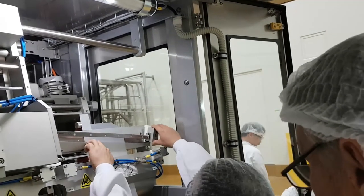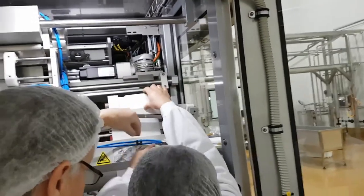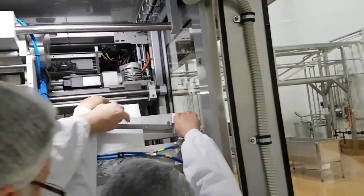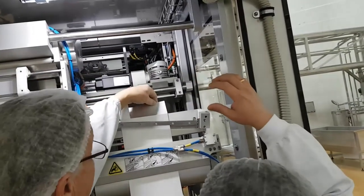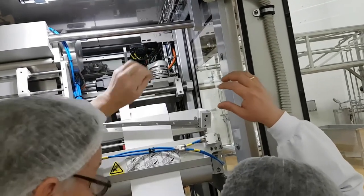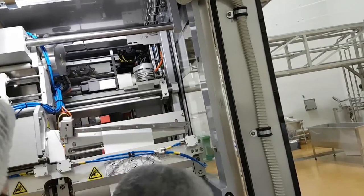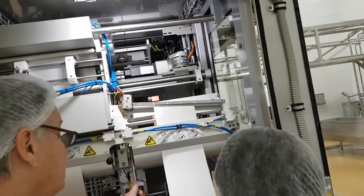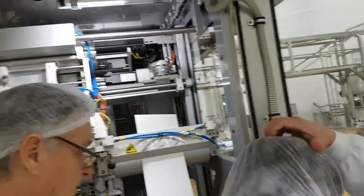Heavy? Yeah. You must hold the material here. Bend with this hand, here, in one movement. Do not let the material sit like this. Take the hand off. Hold the material down like this. Thank you. Okay. Now return the blade. Okay. Check alignment. Check.